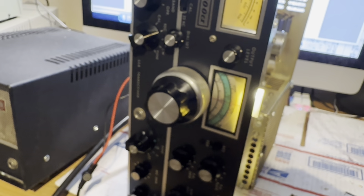Increase the gain until it reads 40 watts at 300 hertz. Now we're going to adjust the two trimmers for 10 watts — there's our 10 watts. I've already done this but I'm doing it again for you. These trimmers here: one of them in normal mode will affect it. Hit one of these for 10 watts — might be this one. No, it's the other one — hit that one for 10 watts.